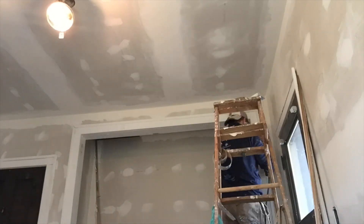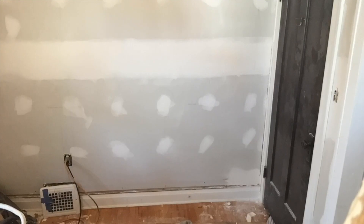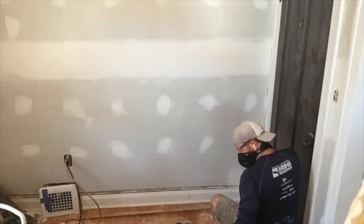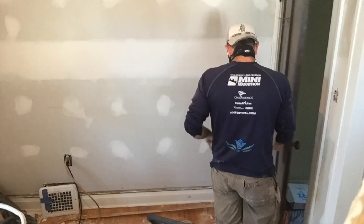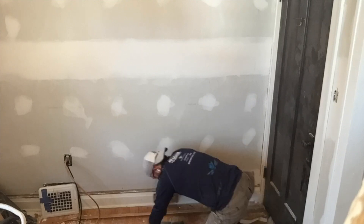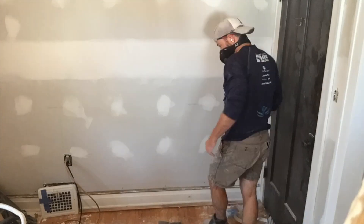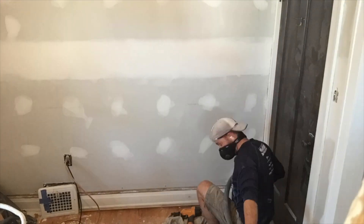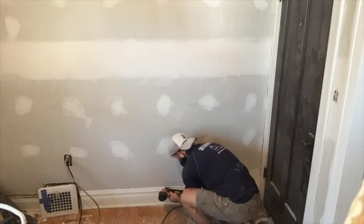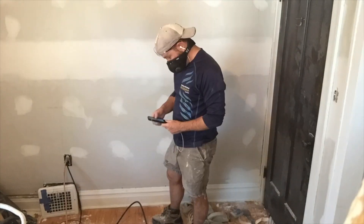For this thinner piece I actually switched up to a brad nailer. You can see the gap between the drywall and the bottom of the baseboard. The top part perfectly matched where I wanted to go, so once I had it cleaned out and ready, this saved me a ton of time on taping — and at the end a little bit of caulk made it go real smoothly. I was so happy with how this turned out because reinstalling that bottom baseboard would have been a nightmare.